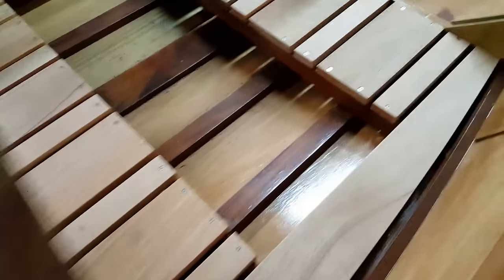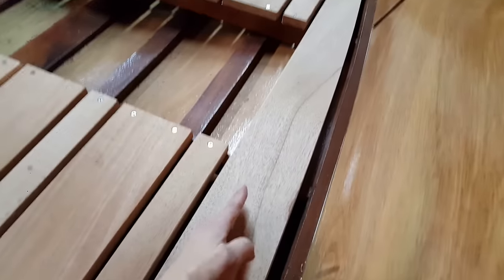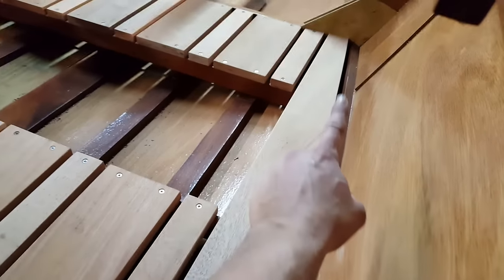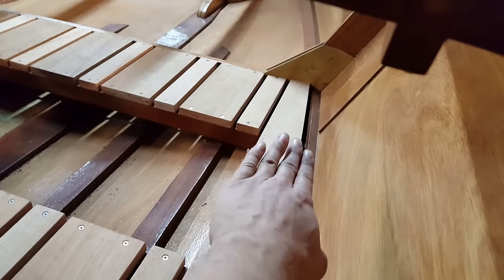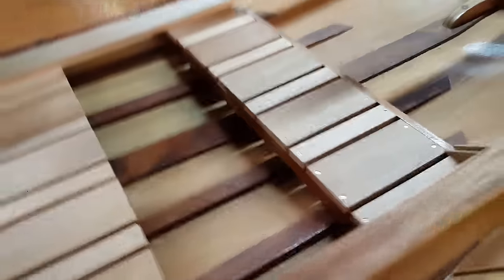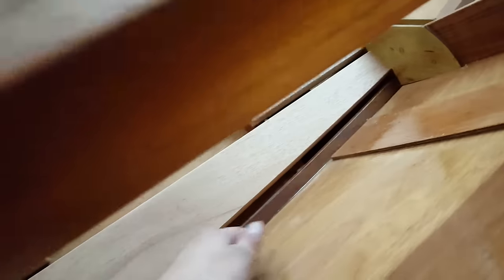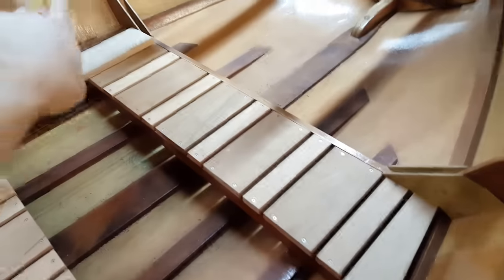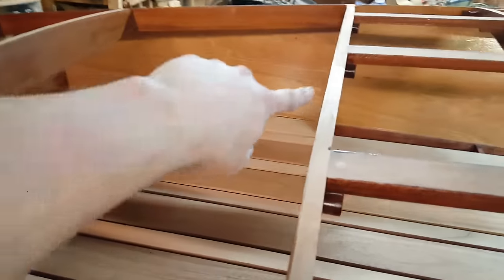Fantastic progress. We're going to have an armrest somewhere in here that comes up about four or five inches and then over to the side of the hull all the way down. It'll run from frame four, about five inches tall, all the way back to the end of the rear cockpit seat back. So there'll be an armrest running down both sides, which will cover this gap here — one long vertical member standing straight up and capped on top.